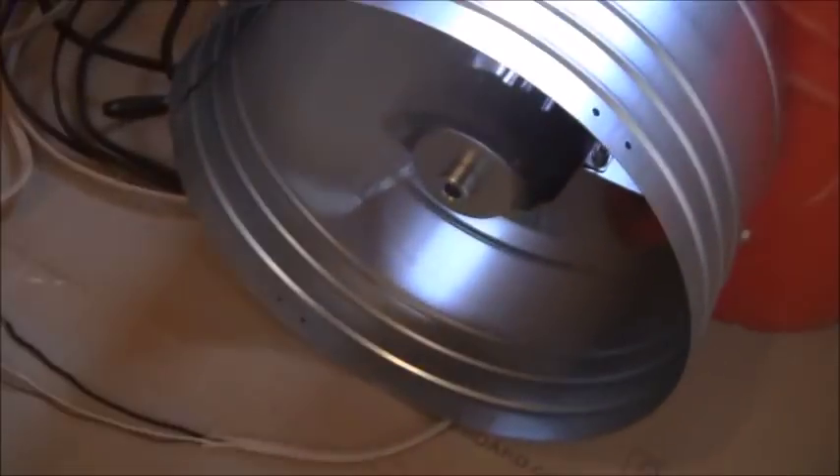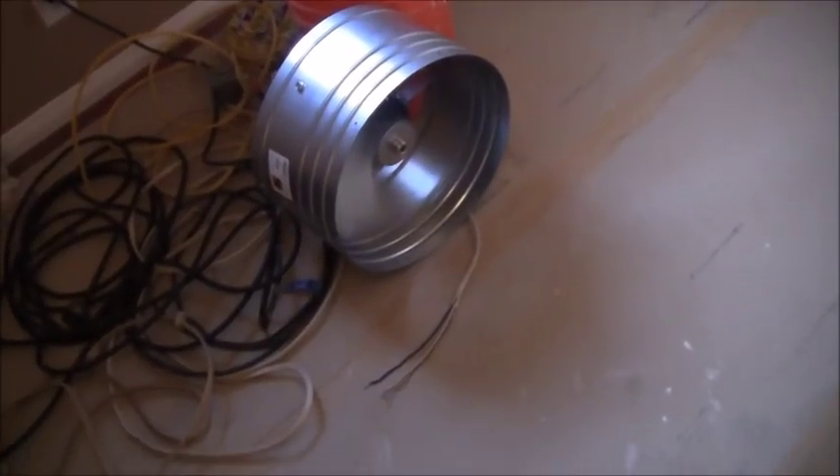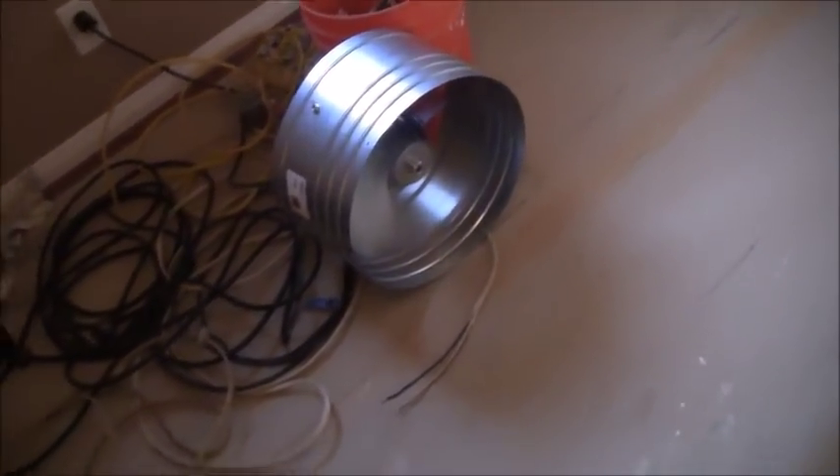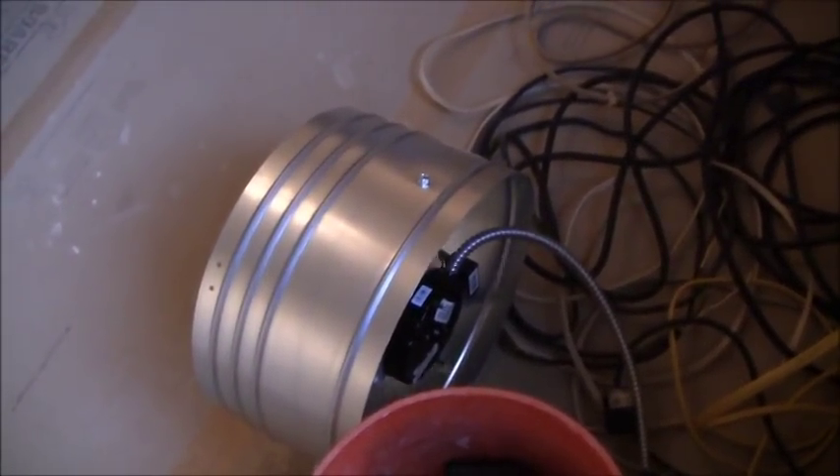As far as the airflow goes, it's not as powerful as the 1600 CFM - that one seemed to be a lot more powerful. But considering this one only pulls about one amp, it's so much more efficient - it's going to cost three times less to run. I do wish it were a little bit quieter. Granted it's going to be up in the attic, but I'm trying to have it as quiet as possible. Without the fan it's noticeably quieter. When I walk out to the hallway, you actually cannot hear it.